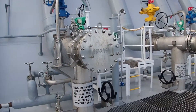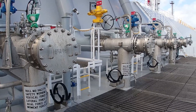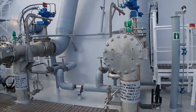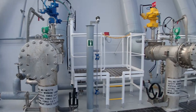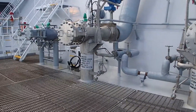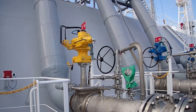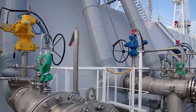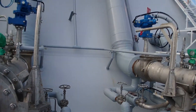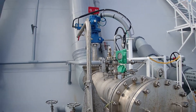Thank you very much, Igor, copy. First we are starting to show ESD and countdown. Copy sir. Okay, start countdown: 3, 2, 1, ESD. So now the chief officer has energized an ESD, ship to shore, via fiber optic from inside the CCR, and we confirm that the valves are closing.